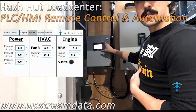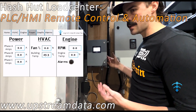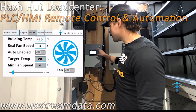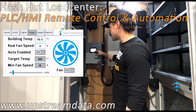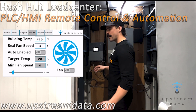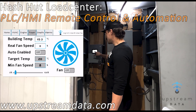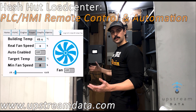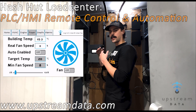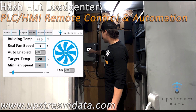It's a pretty simple system — this is the first iteration of this new version. The home screen gives you an overview of power, HVAC, airflow, temperature, and engine status. The HVAC screen gives on/off signals and alarm setpoints. If things go under a set point such as minimum fan speed, you can remotely log in from your phone to control fan speed. You set a target temperature — as long as ambient is below your target and heat recirculation is on, it'll automatically ramp up and down to match that ambient temperature, read from below where the intake air enters the building.